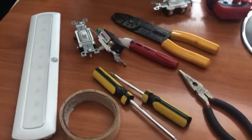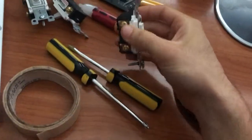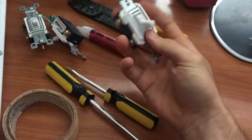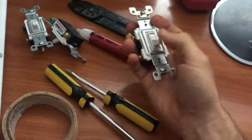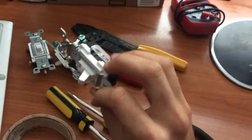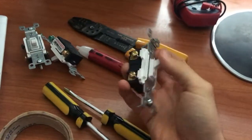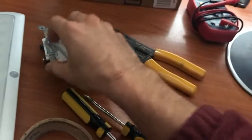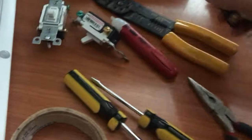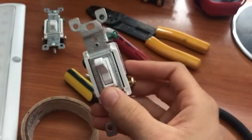When you're at your local hardware store buying switches, make sure you're getting a three-way switch and not a normal switch. You can check easily — if it only has two leads and not an extra little black one, it's a normal switch. Sometimes they're all mixed together on a shelf and you grab two and then realize you don't have the right ones, so make sure you have the correct switch type before you start this job.